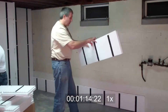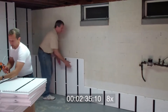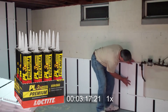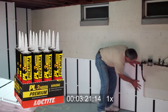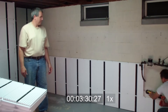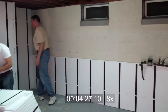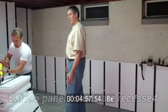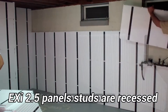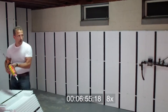Contractors want to know the labor rate. It is a little tricky to estimate — you have to add in their skill level and job site conditions. Not including wall prep or setup times, you can apply three beads of glue, walk over to the wall, press into place, and repeat. The average time is one panel every two minutes, or 30 panels at eight square feet per panel, equals 240 square feet per man per hour. One person can rough out and frame a thousand square foot basement in less than a day.